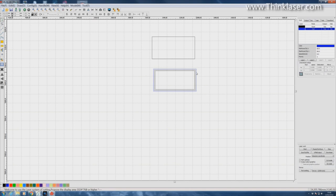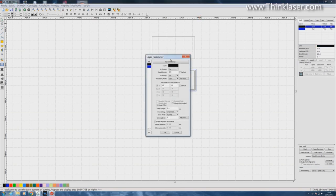So we've got a blue cut layer and we've got black scan layers. Let's just check that. Scan, output, speed. Yes, we decided 200 millimeters was the right speed. We're blowing and we're scanning. And we're doing that at, yeah, 65%. That's what we agreed on. And we're going to set the interval down here. We'll leave that at 0.1, which is where I had it before. So that's probably going to be okay, because it seemed to work all right on the scan tests at 0.1.